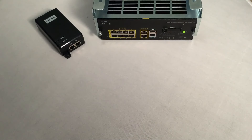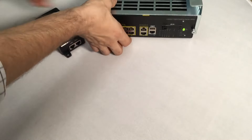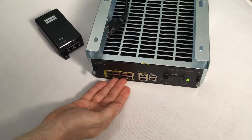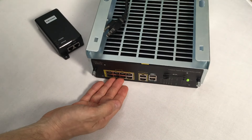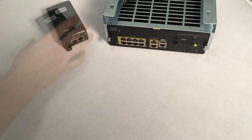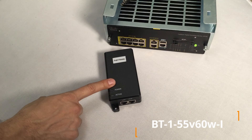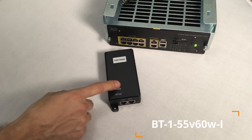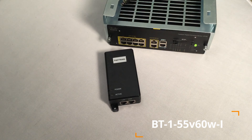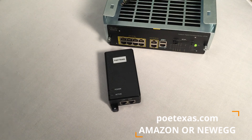Besides the GBT NUC, you need the right kind of PoE installed. NUCs can draw a fair amount of power, so you really need an 802.3BT or UPOE switch or injector. You can use your Cisco UPOE devices and we'll show you how to configure the port a little later. For today, I'll use our BT1-55V60Wi, which is our indoor IEEE 802.3BT dual signature injector you can find on your favorite sales channel.